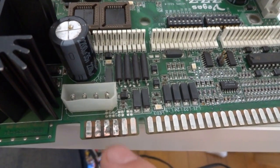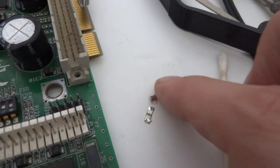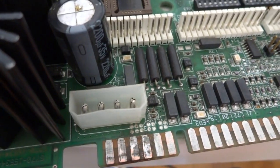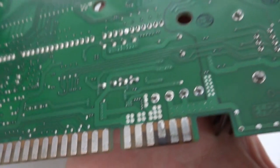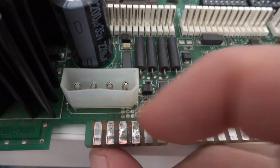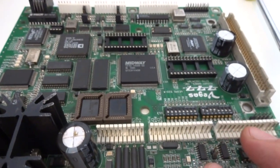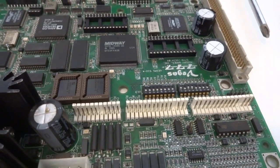What I've done is tried to clean up these areas. Someone had put other tabs over the top of the edge connector — probably because these were a little worn down. I tried to remove as much of the residue as possible and put these flat down again. On the other side there's still a bit of a piece missing, but luckily it's conjoined with the one next to it so it should be okay. The main concern is just making sure these things make contact. There's a little bit of residue still on top that I'll scratch off. The next step is to replace these capacitors and then start changing out chips.